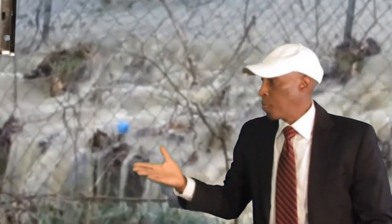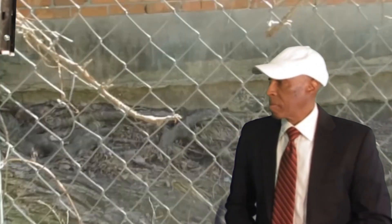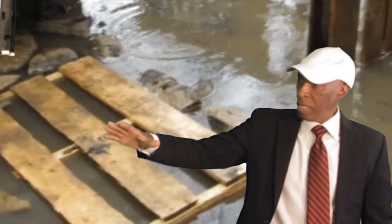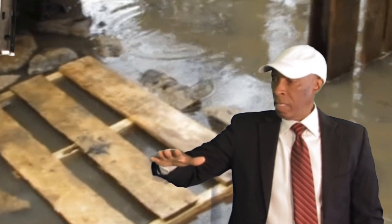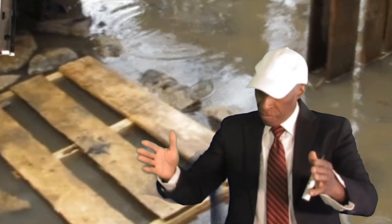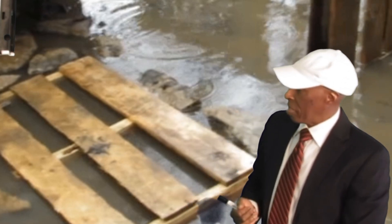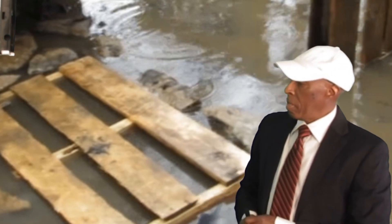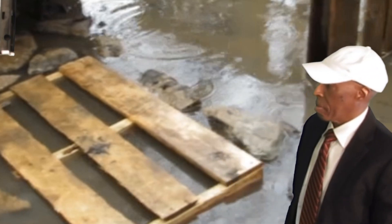The foundation has been exposed because of all that water wiping it out. On my side, the field to the right is a little higher than my property, and some of the water is coming straight down and staying right there. So you've got water from not having any gutters, and that spot being low — it's causing this buildup.